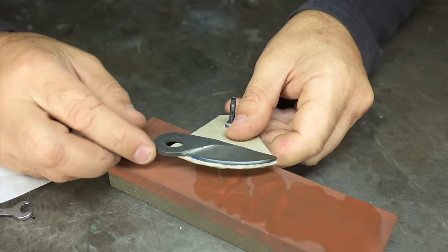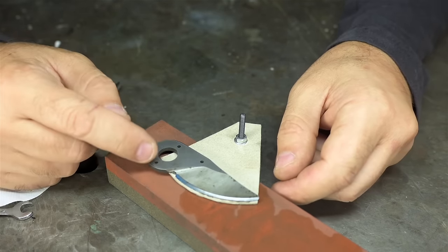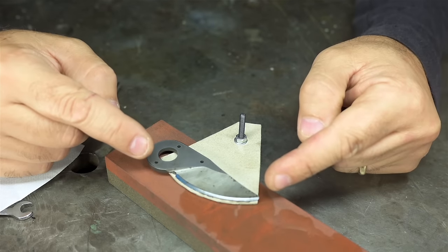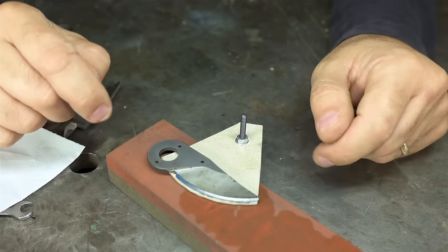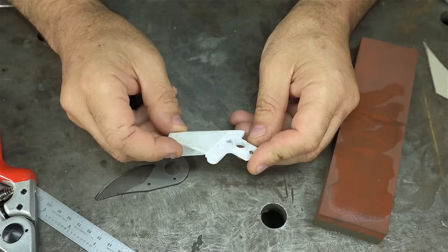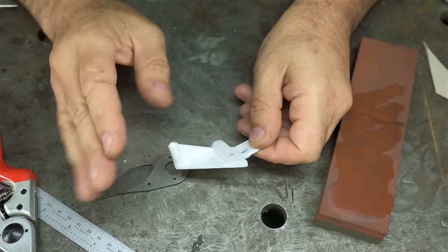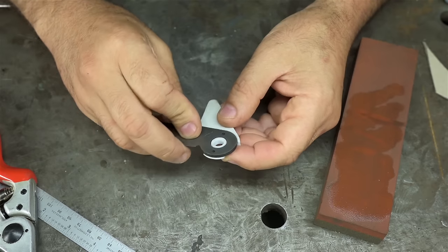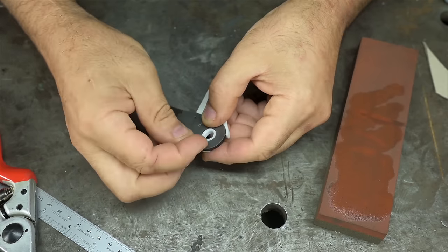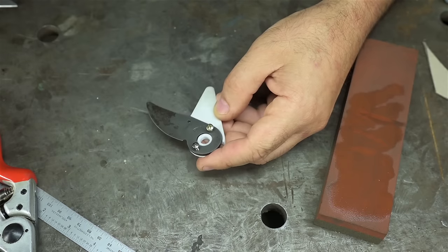This sort of shows we're onto something. I mean, technically, we haven't verified that 22 and a half degree angle. The blade's probably not stuck on there perfect. We adjusted the screw a couple of times, but I'm starting to feel good about this. Oh, I danced a little jig. I 3D printed a little jig. It's the same exact thing we just made with the cardboard, except there's no cardboard involved and no tape and nothing. So in theory anyway, these should be the same exact angles from CAD.